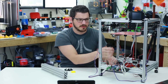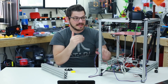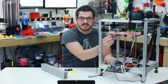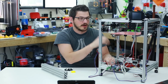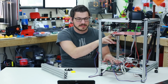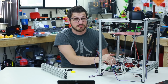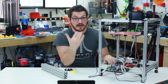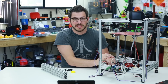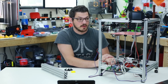I'm not sure if my spacing was off or if the 3D printed parts are just slightly off, but the bed is actually bowing in the middle a little bit because it's so tight on the X. Maybe it'll get a little looser once I put some springs in there. I'm also thinking about swapping to the Anycubic Ultra Base — it came on the Anycubic i3 I'm reviewing right now. It's a heated bed with everything all together in one; all I'd have to do is wire it up to the board. This is probably a PLA-only machine anyway, which is all I really print with.